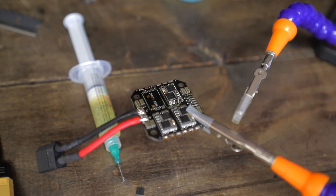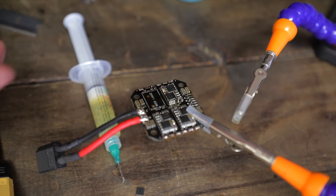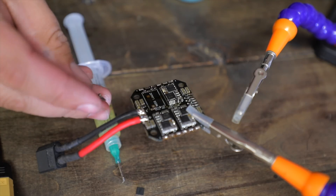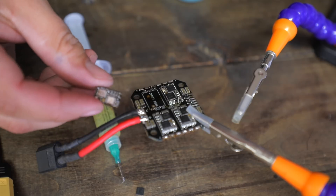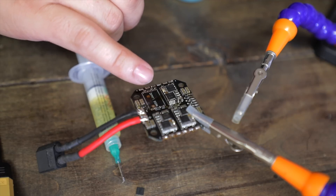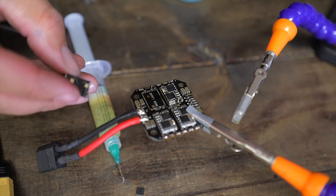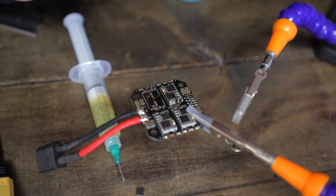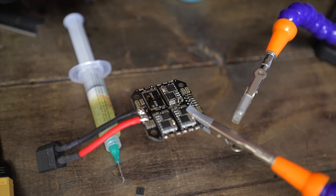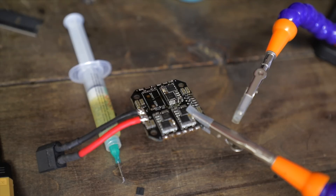Success! The board — that little chip is now soldered into place and boom... we still don't have the third blue light. I guess I could try this guy here next. I am running out of things that this might be. So quick little update: I installed the two chips onto this board. For some reason, two FETs ended up burning out. I was able to get the logic board off after removing everything — it is very hard to get this board off. You can see there are also two points here that go to the bottom, which I believe holds the board in. I'm going to try and get a replacement board off of my donor ESC. I've got to replace the two FETs and maybe this will work. So far this is a complete fail.